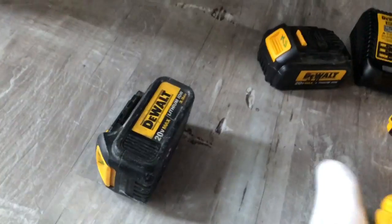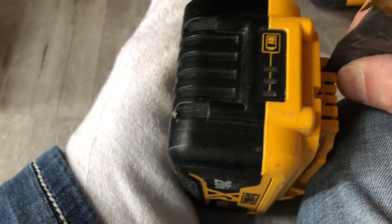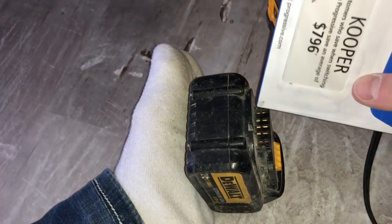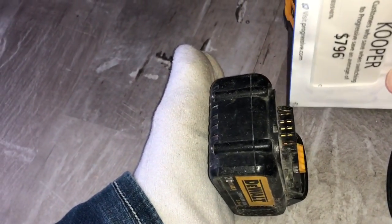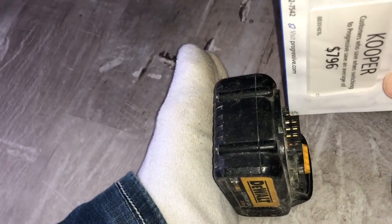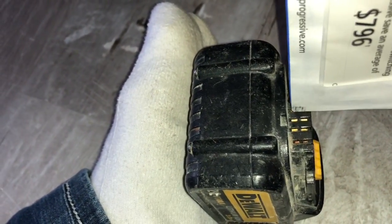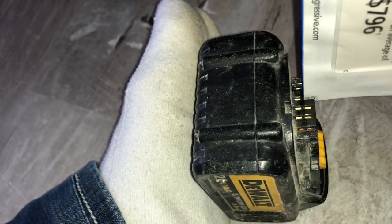Let me try this other battery which I know is completely dirty. There you go — see how that slid in there? I'm showing you how dirty these can get. I sprayed rubbing alcohol and put the sandpaper in. Look at this — I'm probably going to pull off a bunch of black gunk. You see that black stuff coming off? That's all making it not get contact.